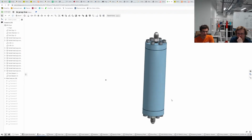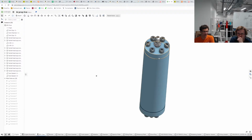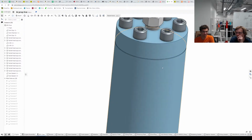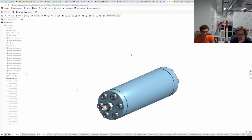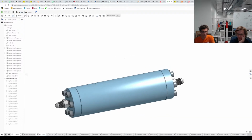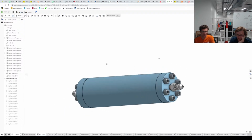Now it's going to be sealed the same way as the engine is, with the foil gaskets. And that's a big chunk of fuel tank. It's not really big. It's a little tiny thing, honestly. 2 inches in OD, 1 inch in ID, but I can't think of any conceivable way, unless we massively overpressurize or the regulator fails, that this is going to explode.